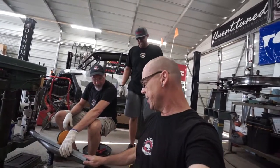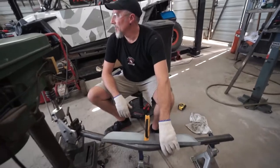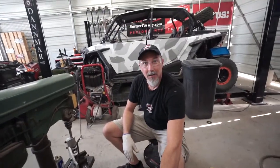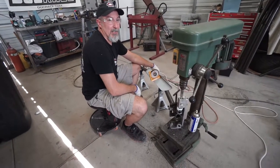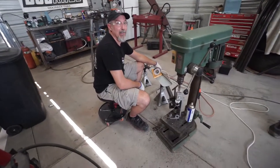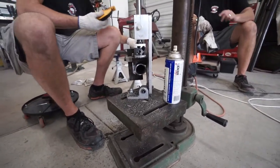Jim actually just made this piece for his Can-Am for a headlight off-road light mount — he just whipped this out this morning. That's 15 degrees, but I don't think that's enough. Those bars are coming back at 45 degrees, so if we only go 15 that's still a 30-degree angle up and I think that's too much. I was talking 10 degrees — take 10 degrees out of the bar right now, because right now it's at 45 following the angle of the bar. Off that 45, if we go 10 degrees it'll get us where we want to be. Let's hit it — I'll go super short so we can trim it again.